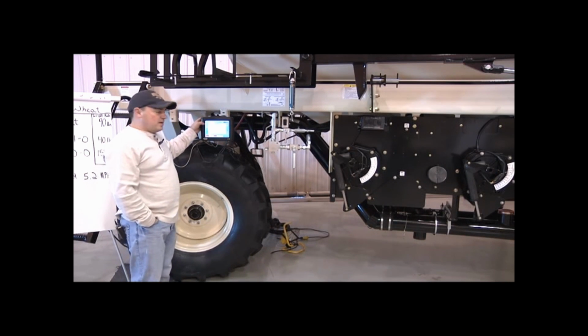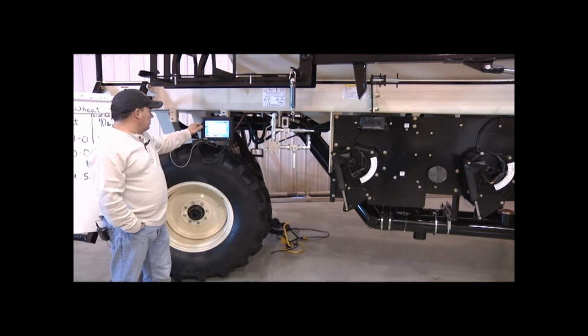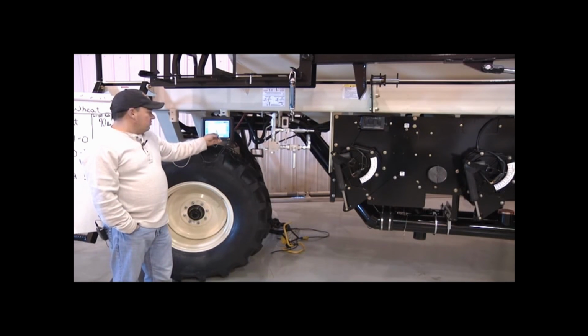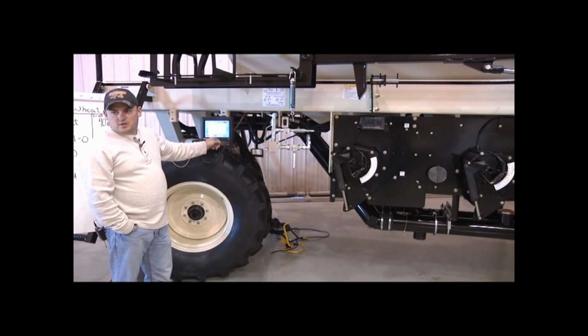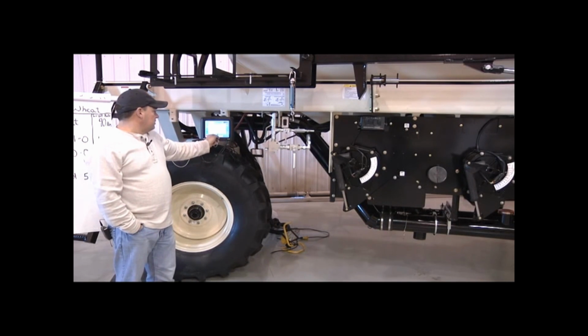Okay. For tank 3, the product is 125100, the old calibration factor of 0.214, new calibration factor of 0.202, percentage difference is 5.7%, and our sample weight of 39. Being 6% out is pretty close. The actuators will adjust to make that up, so we'll accept and save.